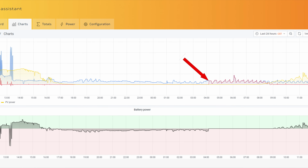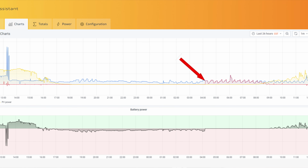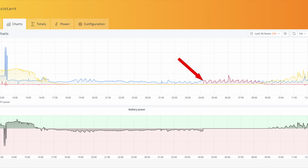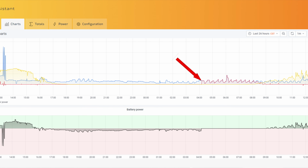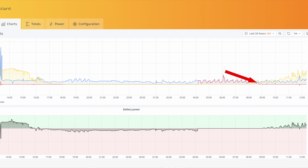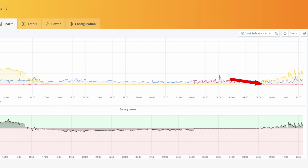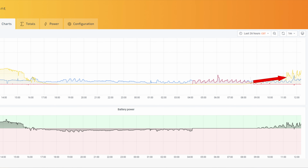And then about 4:30 a.m. we hit the 15% state of charge, which we have programmed into the inverter, and then we went back on grid, or we started pulling from the grid as needed. And then that only lasted for another 4 hours and 15 minutes or thereabouts to roughly 8:45, and then we went off grid, which we are still off grid at the current moment. So basically during that entire test from start to finish, we lasted a little over 18 hours, which I would say is honestly pretty good with a 10 kilowatt hour battery.